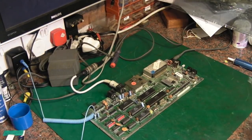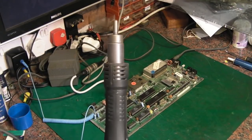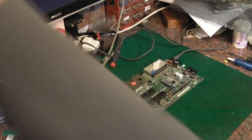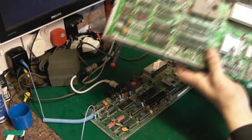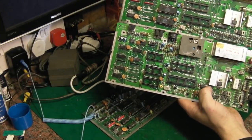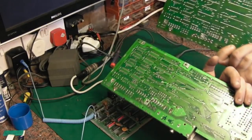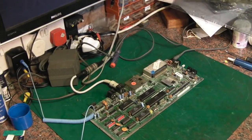The other one came off without damage. I then went to my other technique: for the other two boards I used the hot air technique. I've shown this technique before — it's not one I'd recommend someone just go out and try on their nice vintage circuit boards; it's a technique you need to practice on scrap. But as you can see, I've not lifted a pad, I've not damaged the boards. I still have to clean the holes on these two, but I was able to get all four RAM ICs out of there unscathed, without doing any damage to the boards or the pads. And it took me about five minutes, so it is a technique that can work to your advantage.